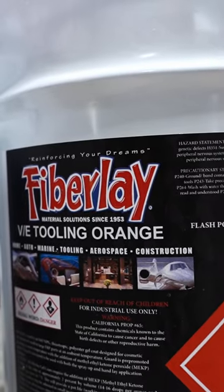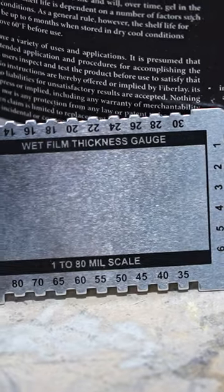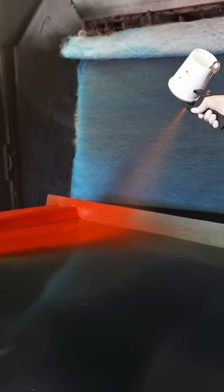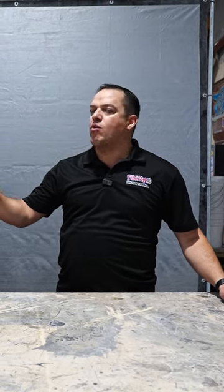This is the orange tooling. It is put down generally between 22 and 24 mils — you can go as high as 26 mil gauge. How we determine that is with a mil gauge. When they're shooting the part, it's typically done in one or two passes, generally two passes, and you can dial in where you are as far as your millage is concerned. Once that's done, you let the product go through full cure and cross-linking so you get a nice, almost tack-free surface.